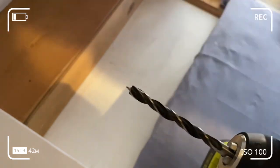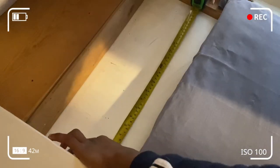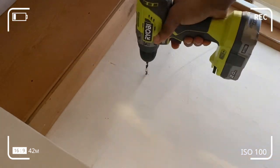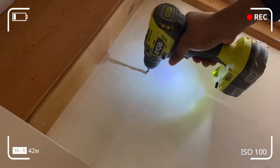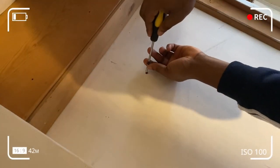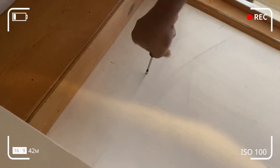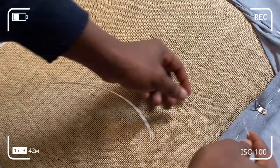The next step is to install your hooks and screws into the wall using the plug. Use a drill bit that's smaller than the plug you want to push-fit into the wall. Measure up your wall area so you know exactly where you want the acoustic panel to sit. With the aid of masking tape and varying the speed to one, drill through the wall. Stopping at the taped area, insert the plug and use a hammer to flush the plug against the wall. If you have a 6mm plug, pilot drill the hole first and open it up to 5.5mm so the plug is push-fit when hammered in.